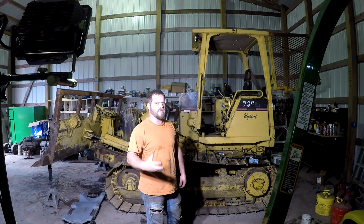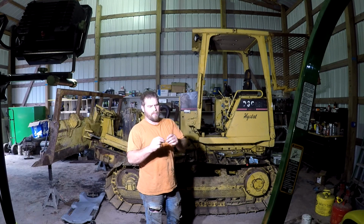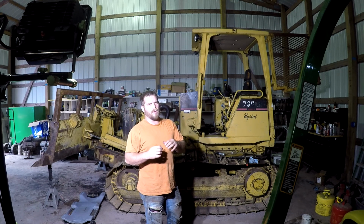For those of you who missed the first video when I took the engine out, the wires I'm talking about were a wire harness that had four wires in it. They're big wires, about 10 gauge, plugged together. You're supposed to be able to unplug them, and that little wire harness was melted together. I think a couple of those wires go to the glow plugs, and I'm not sure what the other ones go to. But anyway, I had to cut the wire harness because I could not get the thing to unplug.